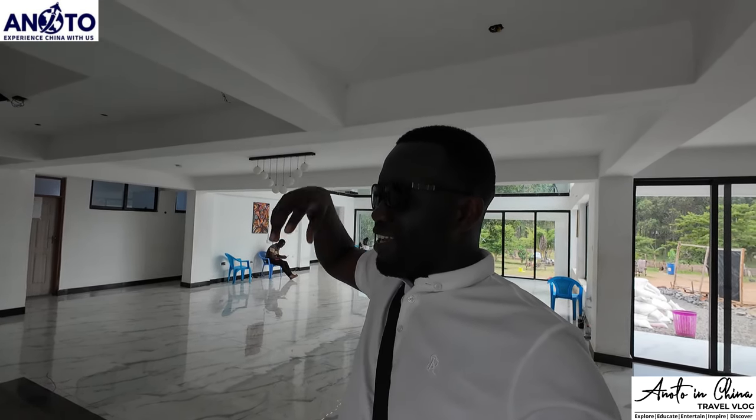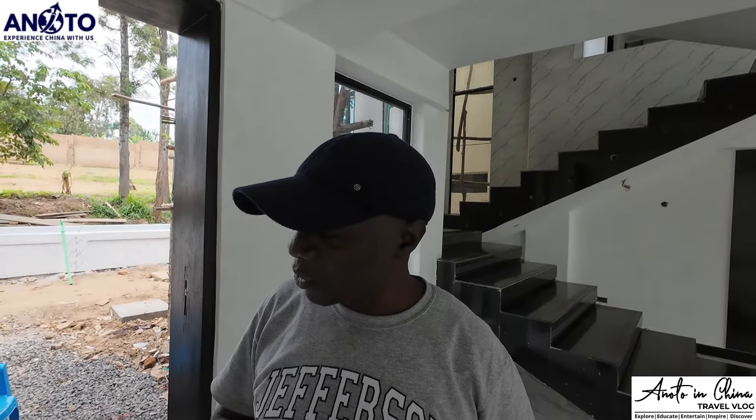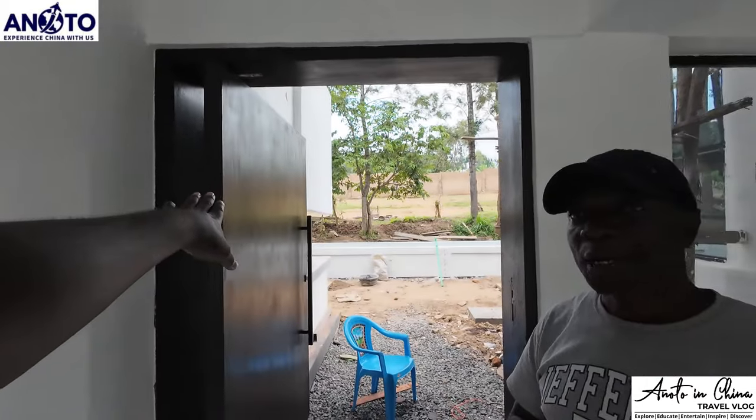I've never paid attention to how they suspend the door. Having seen this door, you can go and watch. The other way to suspend a door like this is to use those classic old door hinges, but then you need a very massive frame, so that the hinge will eat into the frame, then eat into the door. Otherwise, standard hinges cannot hold it. That's why it is easier to use a pivot, to balance the weight as well.